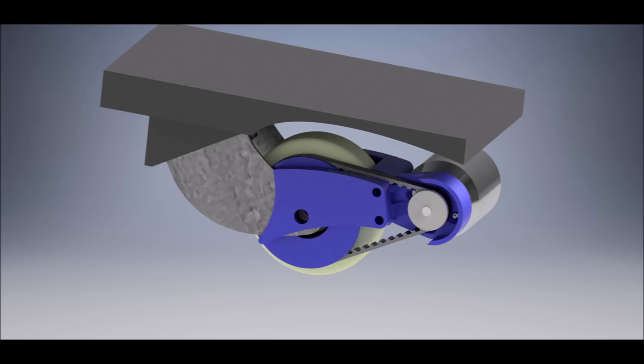I designed these blue parts that basically hold the motor out from the back axle and support the whole drivetrain system. I also CADed the wheel, and after I had the wheel I was able to CAD a pulley that fits directly into it. So these are all custom parts — I'll have them available for you guys to download and print on your own. I printed them in PLA.